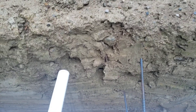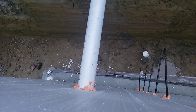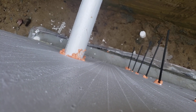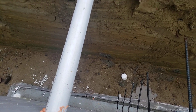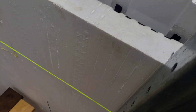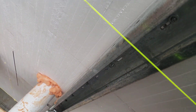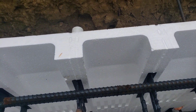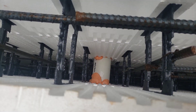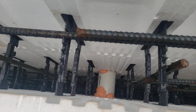The other thing we've got going on here is proper planning. You've got one of our utility pipes already planned for — you can see it zips right through, and it's already foam sealed here. Knowing the placement of all these utilities allows us to put those in and then simply pour the concrete around them.